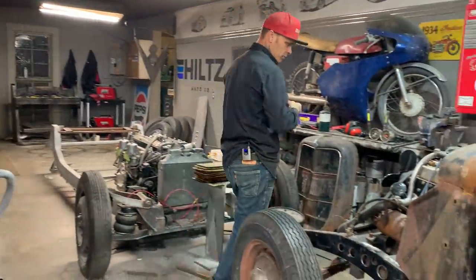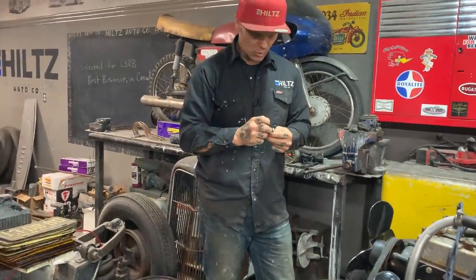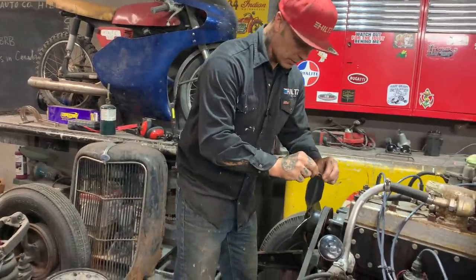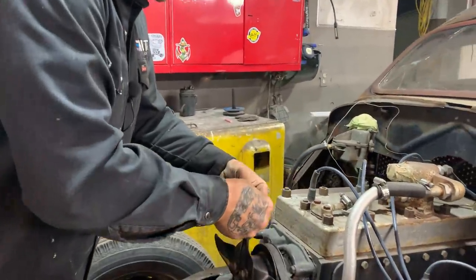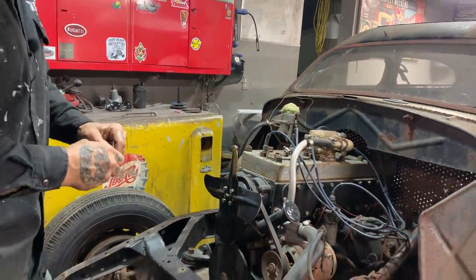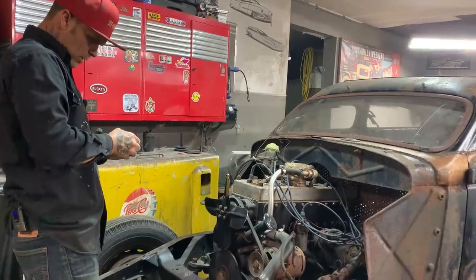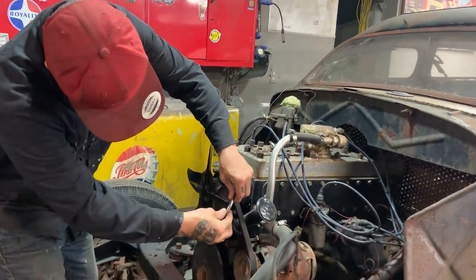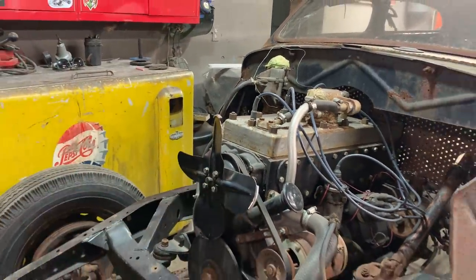And that's what I'm going to do. It's going to mount on there. Basically, I'm going to put it where I think it needs to be fit, and we'll go from there. That's the way you would do anything, I would think. You would mount it, hold it where it's mounted or where you need it. That's what we did with the steering column. We put it where we needed it, and then we weld it to it. Basically, I'm going to do the exact same thing. I'm just going to use these for clearance. Not sure what that would be, but it seems like it would be enough.